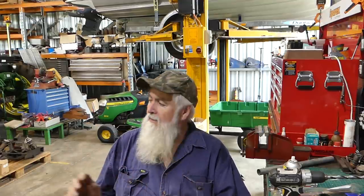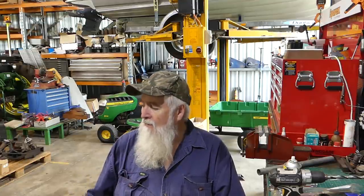So you've noticed in the video that when the arms were lifted, I knocked the cam down to have my quadrant fully forward. So I knew that was my raised position. I knew the quadrant was at its full forward position. So with the arms as high as they could go, the quadrant right forward, by knocking that down there, that was as high as everything could go at that position. So when the linkage arms come up to the high position, the quadrant had moved its full travel forward, so all the lifting had stopped. So look, I think it's a good thing.